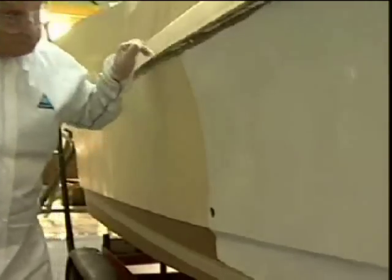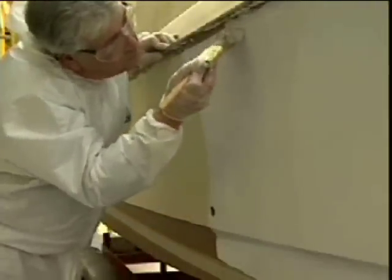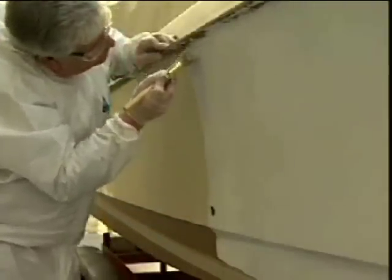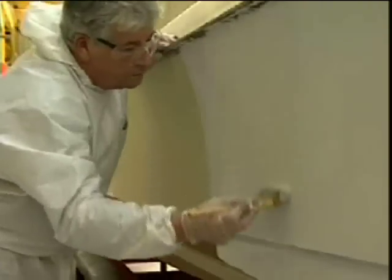Move to the next section and roller and tip off with a brush in the same way. Along the overlap, quickly work the brush horizontally over the surface to merge the layers together. Then lightly tip off with the brush vertically to finish.